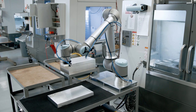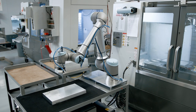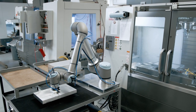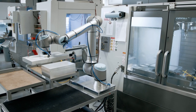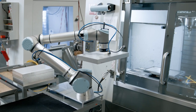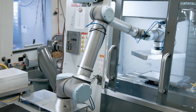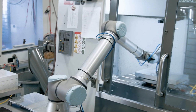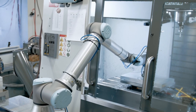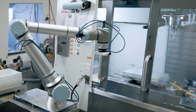Once it feels force, it turns off the vacuum gripper, goes to the common waypoint, takes an image of the pallet, descends to its center point, and then runs the process of loading the pallet into the machine. The door opens, the robot swings around, pivots into place, stops a quarter inch above the pallet, descends in Z looking for force. Once it does, it turns the gripper off, comes out of the machine, closes the door, and returns to that home position.